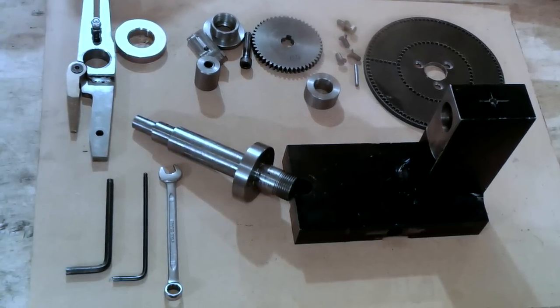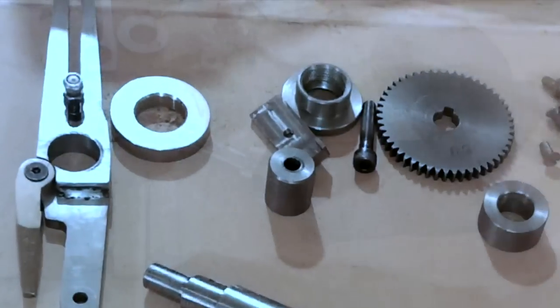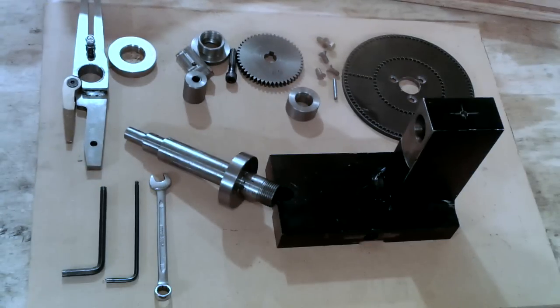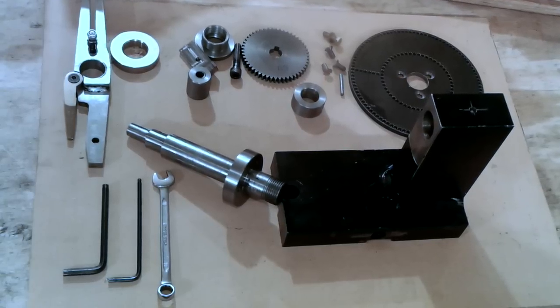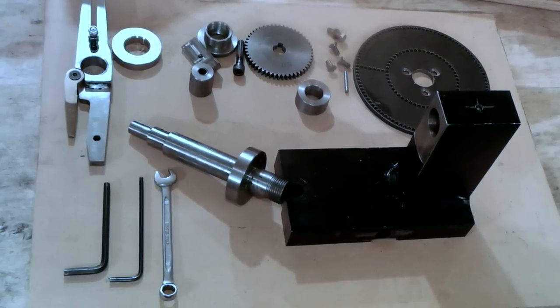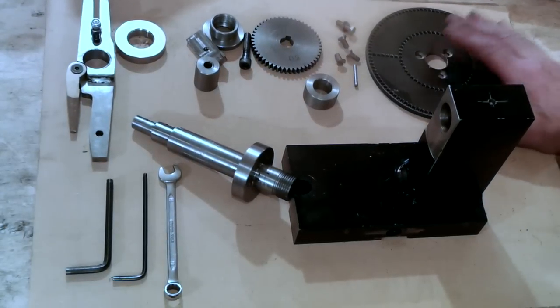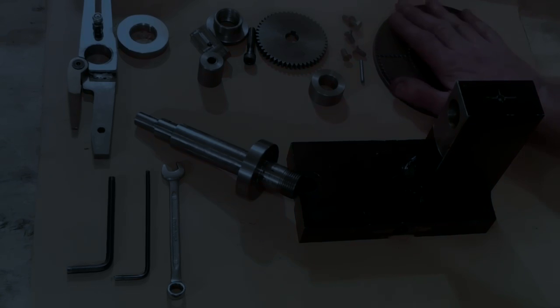If you look at the index arm, you'll notice there is a nut and bolt in the slot. In the centre of the nut and the bolt there's a very small indent. This very small punch mark plays a very important part in setting the PCR. A corresponding punch mark exists in the end of the indexing shaft. I'll explain its function in a moment, but first I'll assemble the device.